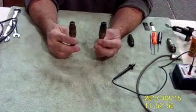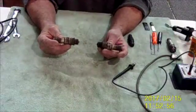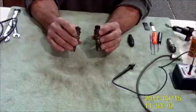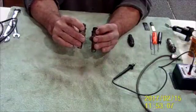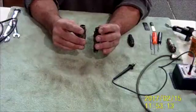For most of us, we have eight in our airplane. As you can see, when they come out of the aircraft, they can look pretty bad or they can look pretty good. You can't look at the condition of a spark plug and tell what's really going on. On the business end, if you see carbon and stuff like that, which we see on a lot of plugs, you can also see that there'll be some lead buildup inside the plug. We're going to talk about all those things.